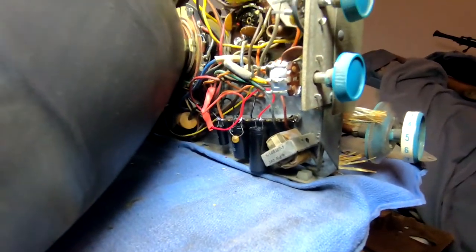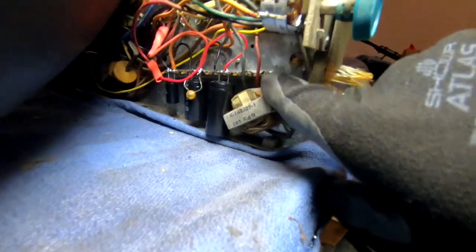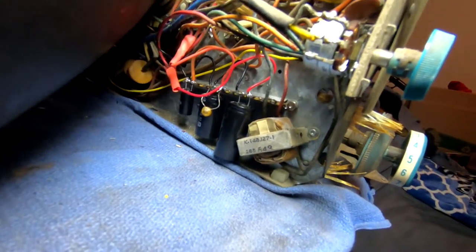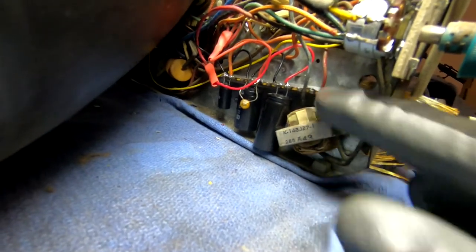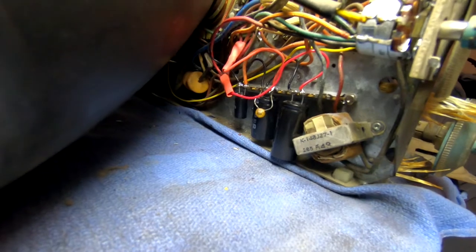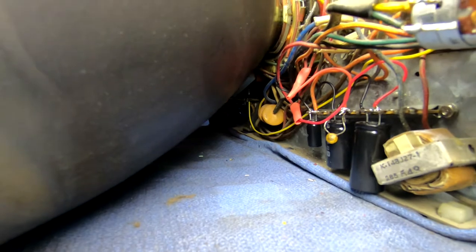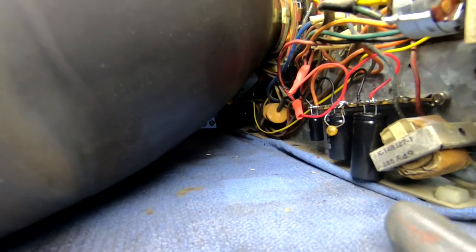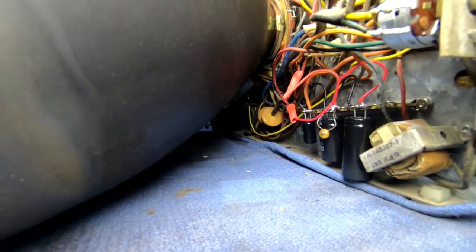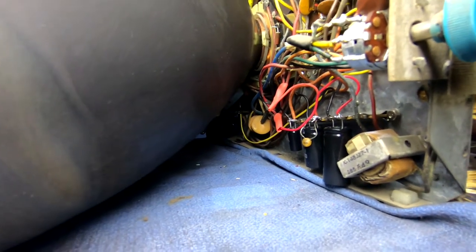What I did in order to make room for these, though, is I drilled out the rivets holding the two clamps in place and ditched them. And the screw that actually holds the fuse block in place on the other side has a retaining nut just the right size for this terminal strip, and then I put the capacitors in order, so the 68 micro, the 200, and then the 30 over there, and spliced the necessary wires to them. They all have a common ground. Now what you can't see, unfortunately, is way in the back there, the initial 300 microfarad capacitor is tied to the terminal strip that the person that put that diode in there and replaced the selenium kindly left me, which has a center negative post. That came in super handy. I was able to direct mount it. And with the CRT in here, I can see there's no problem with it being too close. So that's good.